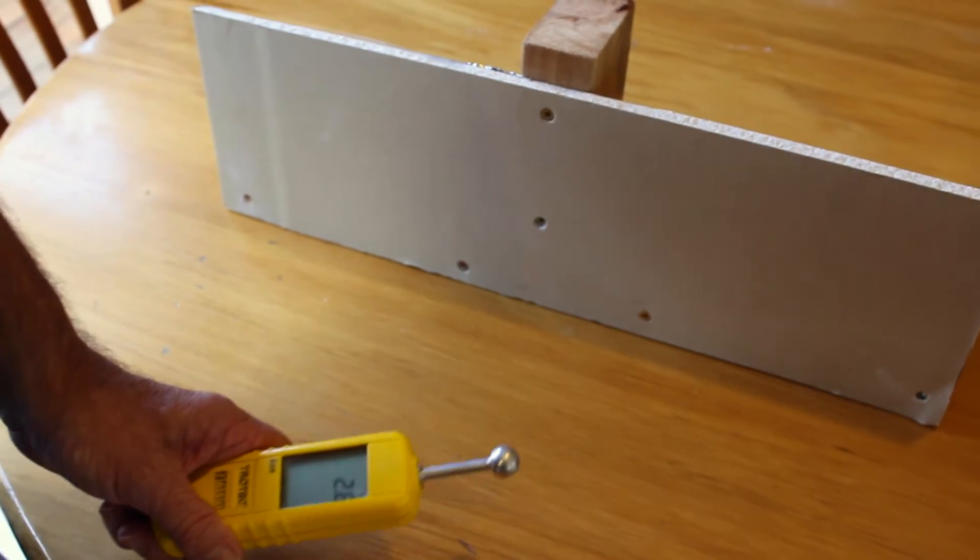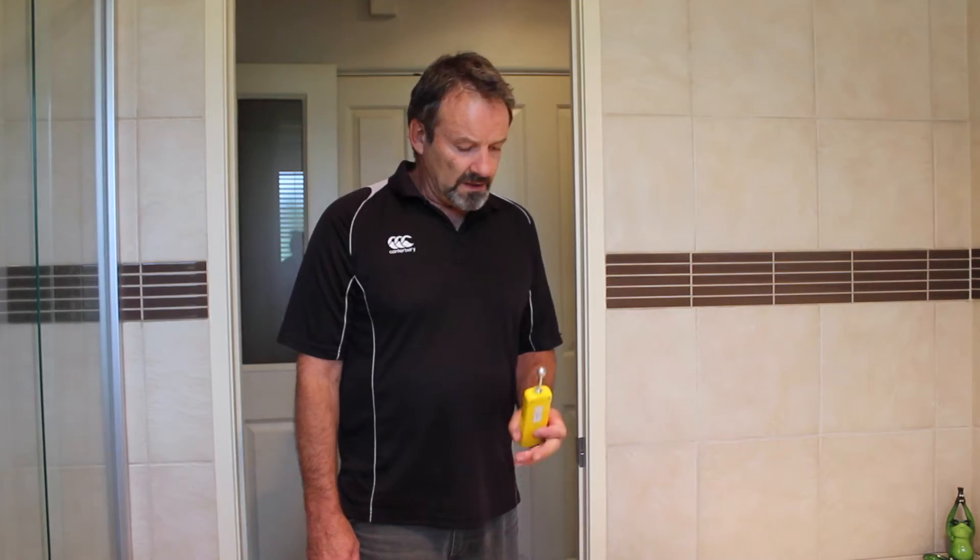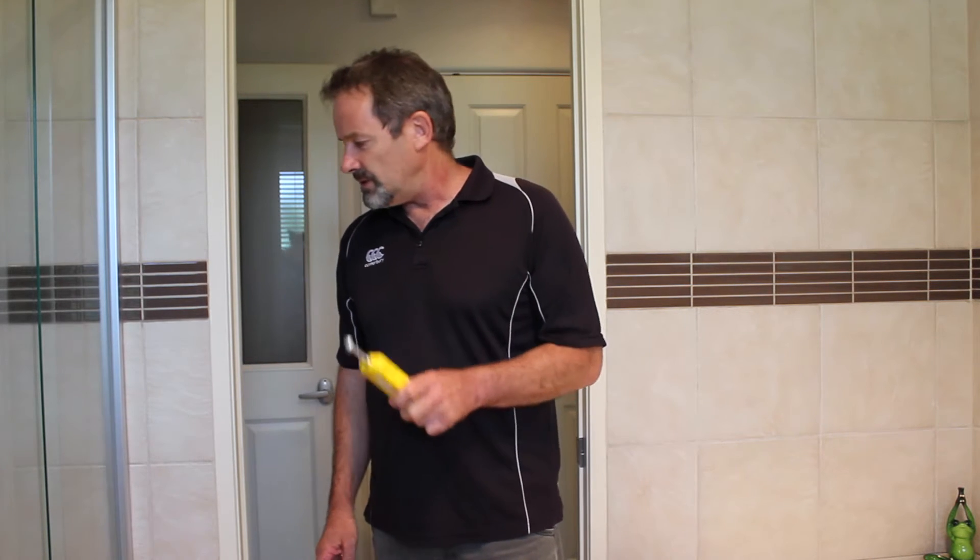The wet area, although not visible to us, the IR camera can see it, allowing us to put the moisture meter directly on the anomaly area. I note a number of YouTube videos show people testing tiles within a shower cubicle — there is no point doing this. Tiles do absorb moisture and grout will allow moisture through; that's why we have waterproof membranes. All this tells us is that there's moisture on the tiles, which is usually just an indication that somebody has used the shower recently.